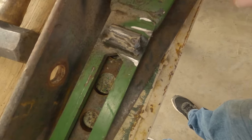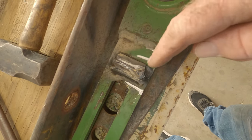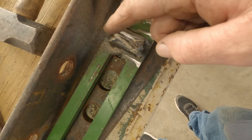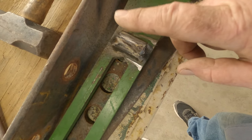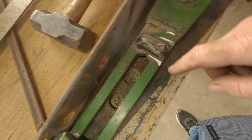You can see right here where I've ground this and over here where I ground this, and I've still got this little piece in the middle. I want to make it kind of sharp, so I'm going to put another weld right across there and grind this again to bring that up. The weld will probably be stronger than this metal was.